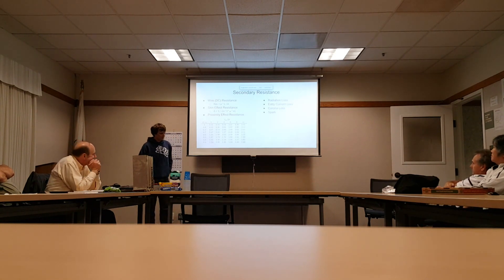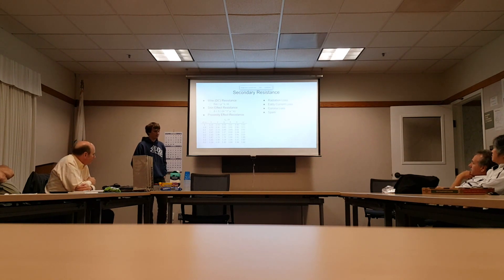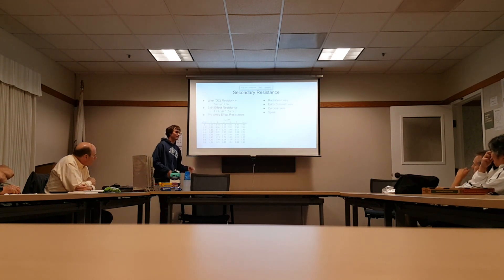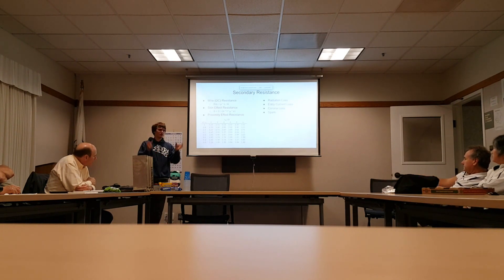At 50 kilohertz versus 500 megahertz, we're only different by a factor of 100 in skin depth, even though it's a factor of 10,000 in frequency — because of the square root. So the skin depth doesn't go down very quickly. Basically, you're only going to get current flowing through maybe two or three skin depths; it decays exponentially as you get into the wire. You end up with a conducting band around the edge of the wire, and the interior of the wire is not conducting.